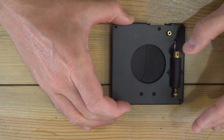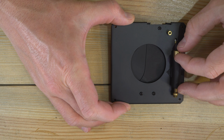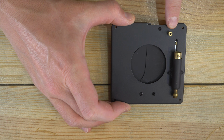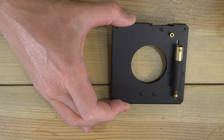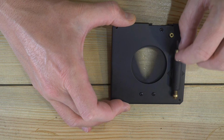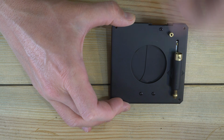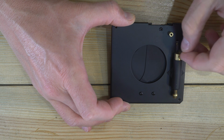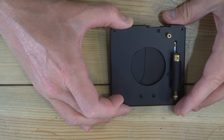So here's the actual shutter. These work mounted vertically because they need gravity to close. This is a number 6, by the way, and it can work in both time, where it opens and then closes, or instant, where it'll open and close with one bulb press. You'll see that in a second. The difference is whether or not there's a pin in here. I haven't gotten that far yet, but we will.